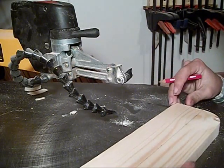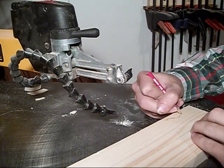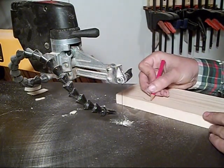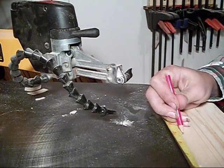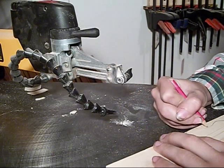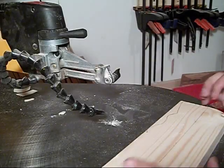I'm at the scroll saw now, and I'm coming up with something to make up on top. I figure I can take something and maybe just draw out some type of design. I need to measure and get the midpoint so I know where to stop, and then when I come out one side, I can trace it and use it for the other to make them identical. Now this is ten inches, so five will be my center. I can come out from my line there and come down, just come up with something that might work or change a little bit. I can go back and add things, but I'll cut this out and see what comes up. I'm going to begin to cut this out and we'll see what happens.